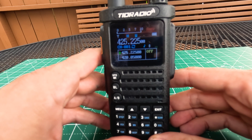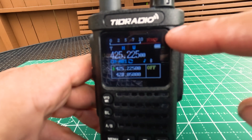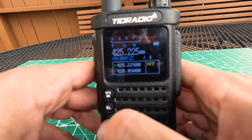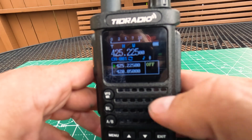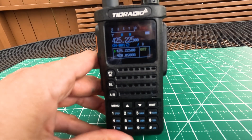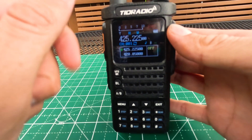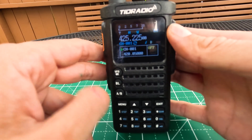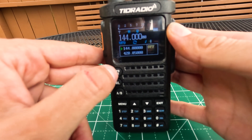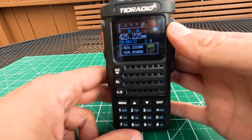Here is the front panel of this radio. You can see we have a colorful display — it's fairly bright. At the top we have our power meter, and we have our current frequency displayed down here. It'll show channel A and channel B because we can switch between A and B by pressing this button, so we're able to see two frequencies at once. I've done a couple things before starting the video — I turned the backlight on so it stays on all the time, and I changed it from VFO mode to channel mode. You can press this button to go between VFO and memory mode. I get local interference on 144.000, so I just switched it over to channel mode.